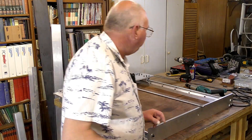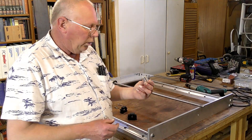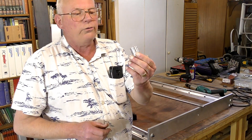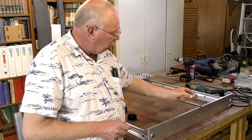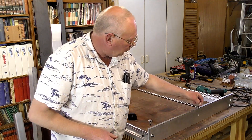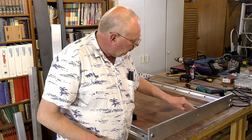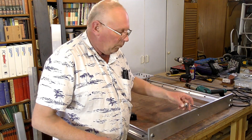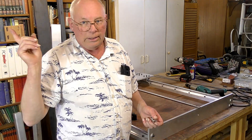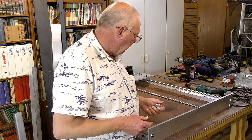To enable all that to happen, I have to cut a hole in this half-inch thick aluminum — clearance size for this coupling to run just inside, because the coupling is going to sit just on the inside of this plate. Then I'll build a housing over it, like I've done on the x2 mini mill and the lathe — very similar coupling arrangement, works very well.